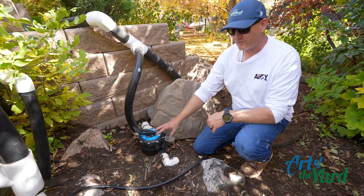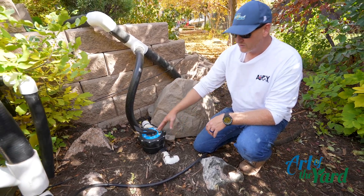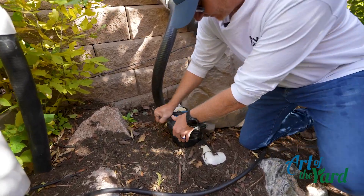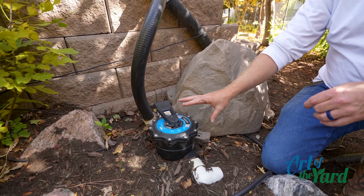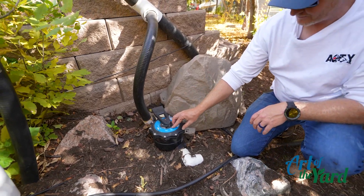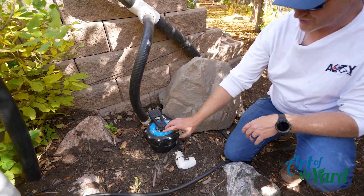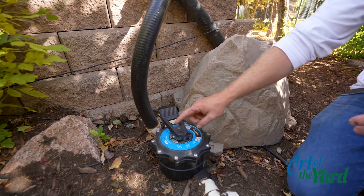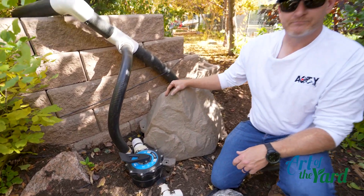On this system we run the Ultima II filters year round. But if you're going to turn yours off, first unplug your pump and then rotate the handle to the winter setting — this drains the head and prevents it from freezing. If you don't drain the head and it freezes, you can crack the plastic and have a leak come springtime. Set it to winter, and remember to flip it back to the filter setting in the springtime before you plug your pump back in.